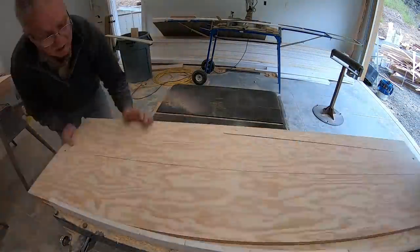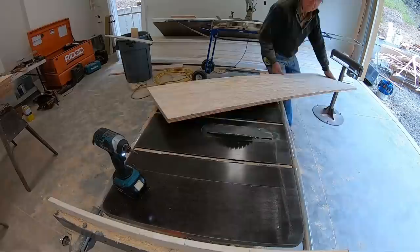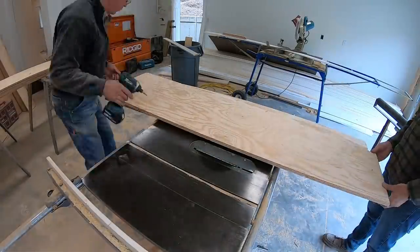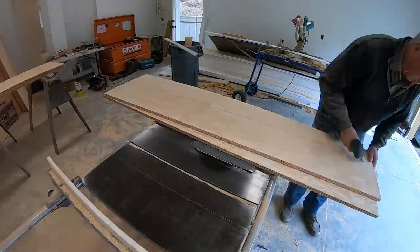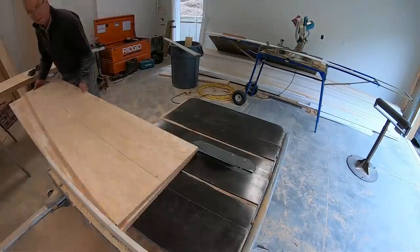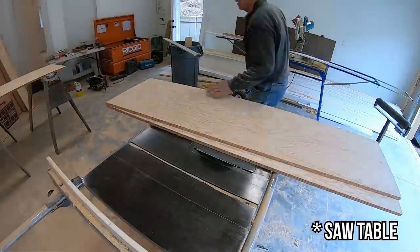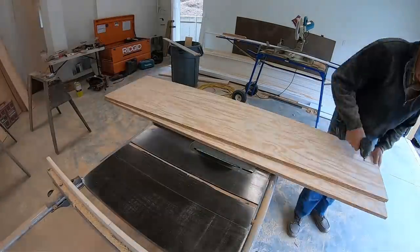As I watch this video, I almost can't even explain how I did this. I used a plywood rip for a straight edge, drew a center line on each of the pieces, and then used the straight edge to rip half the taper off of each side while carefully keeping track of the direction of the bevel. The whole process was complicated by the bowing of the material and having to keep the surface in perfect contact with the saw blade regardless of the bow. But anyway, we made it — and really only wrecked two sheets.